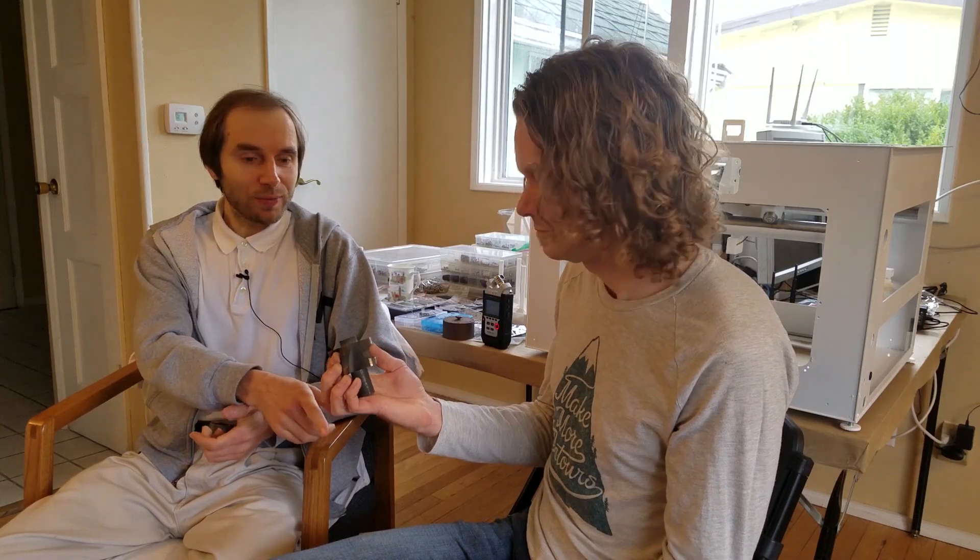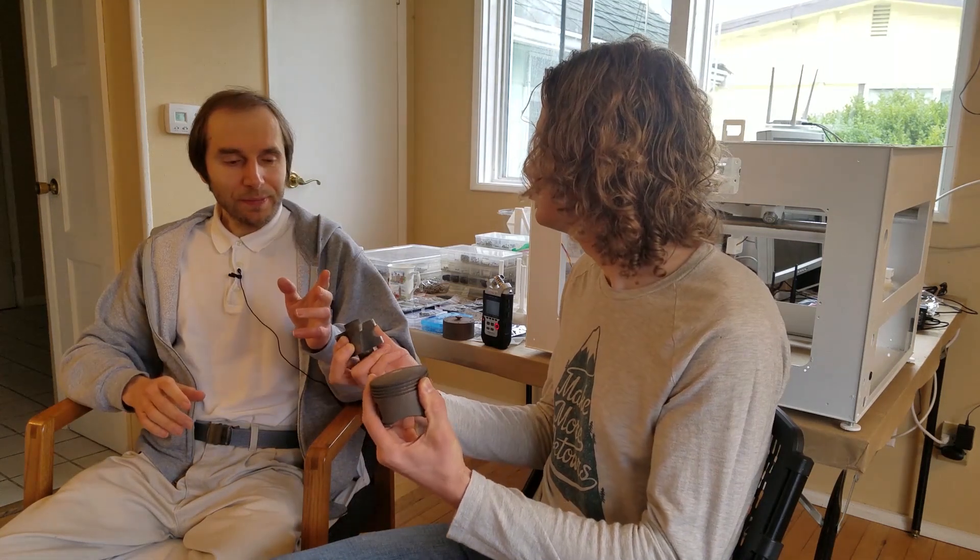Where do you want to see these printers in the future? Right now it's more for experiments and educational purposes, because those materials are not very applicable for practical applications. They might be perfect for a prototype, but if you're talking about mass production — copper is too expensive, high carbon steel is very hard to post-process, nickel is more expensive than copper. We might see wide use when people figure out where to get high temperature kilns, or kilns with controlled atmosphere for stainless and aluminum.